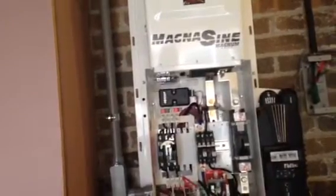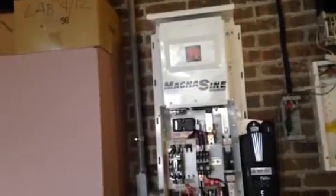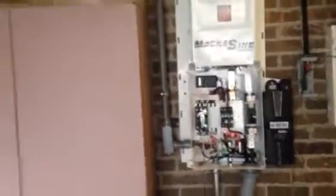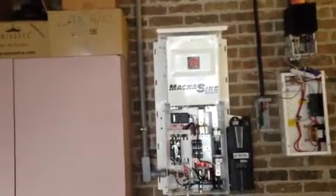So here's the Magnum — this is kind of the flagship platform. Most of my systems are Magnum 4448, 48-volt systems. These inverters are really nice. This is a 2,000-watt, 120-volt inverter, but the majority of them are 240-volt out of the box. That means you can have what they call split phase, which is basically house power out of the box. You can power anything that you can plug into a wall, and you can also run 240-volt loads.